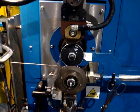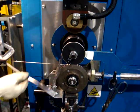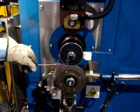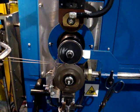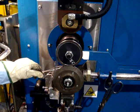Additional spot welds are applied. Once the ID of the gasket is defined, flexible graphite filler is now added and is wound spirally with the metal. As the OD of the gasket builds up, it has reached the point where we're almost to the final OD of the gasket.